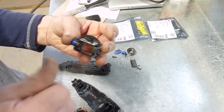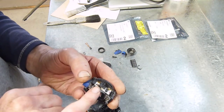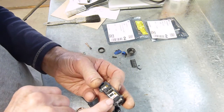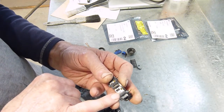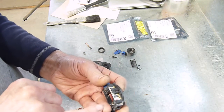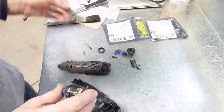Since this pad was lifted, I bent it back down after I pulled the board out. The lights pull apart like that and the contacts are inside. There's the slider — that's the variable resistor right there, that's a wear item. The tracing can wear out from videos I've seen. This is the diac — basically it's like two zener diodes back-to-back. I'm guessing its value is around 30 to 40 volts, which is fairly typical for a circuit like this, so that's what I ordered.